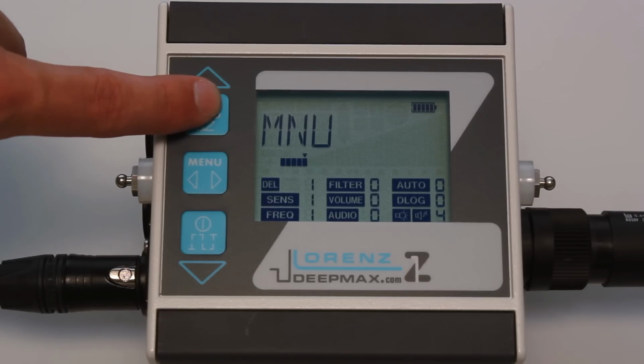Position 4, a low tone will indicate ferrous metal objects and a high tone will occur when non-ferrous metal objects or hand-sized or larger ferrous metal objects are present. Position 5 is for a double D coil. There are 3 distinct tones: a low beep tone for ferrous, a high beep tone for non-ferrous or large ferrous metal objects, and a medium beep tone for weak indications or small low conductivity objects.